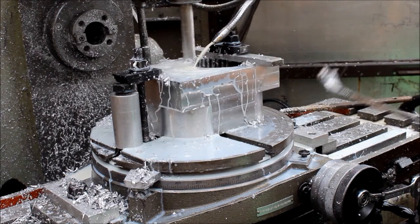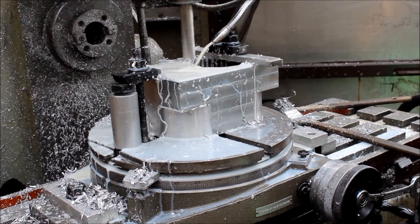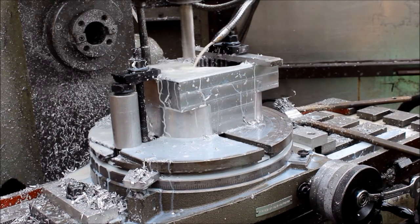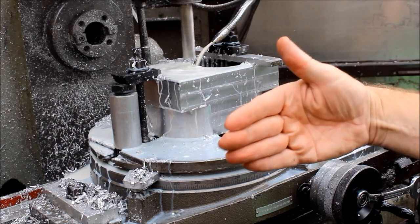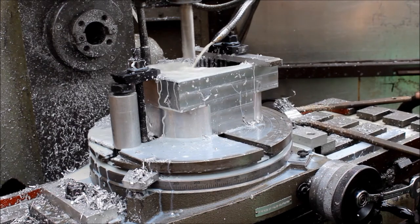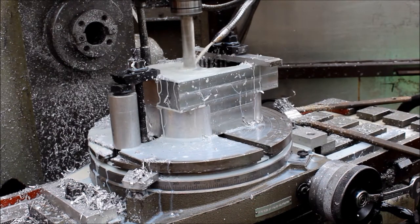Okay, still a little hole. We have to go around — it's actually, like you say, the boring head's two and a quarter diameter, so you need a big hole in there before you get the boring bar in there. So you can just move this piece now this way in a bit. Got another three mil. Three mil. And spin round again and go down, then start to move this.